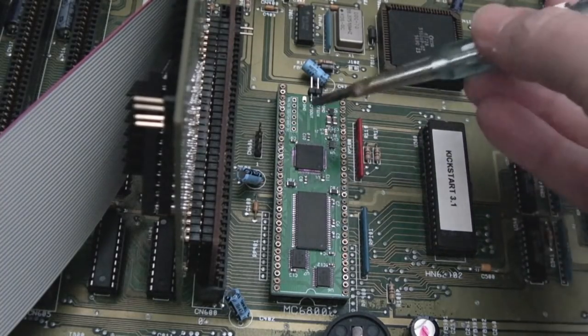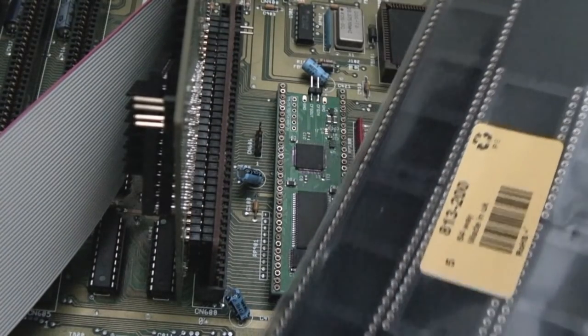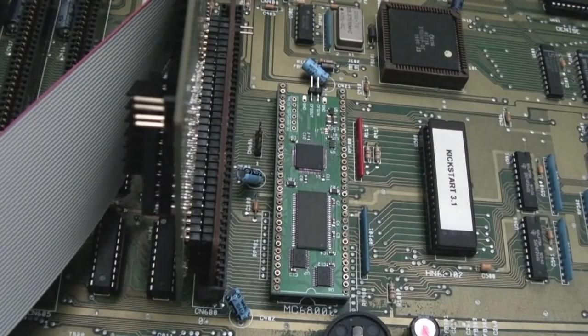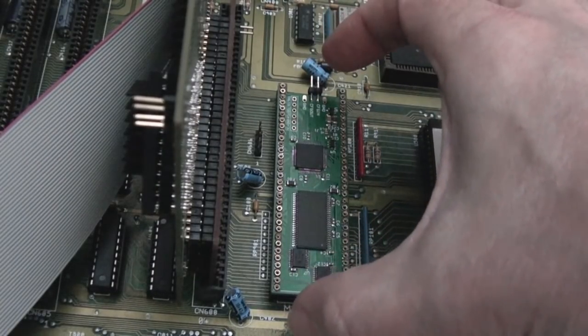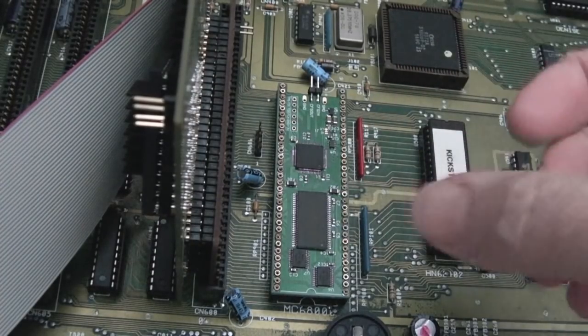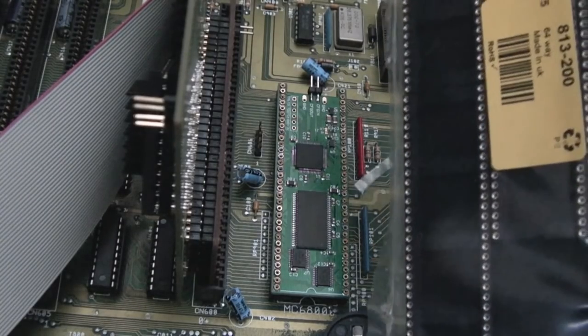So yeah, I will be removing the socket on here. It's fitting a turned pin. One of these here, you can see these are brand new ones from RS, I got a fair few of those. But what I will do is reclaim the old one, because the pins are not too bad on that, and I'll remove each of the pins, retension it, and then put it back together, and it'll do as a replacement socket should I ever run out of these ones.